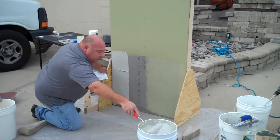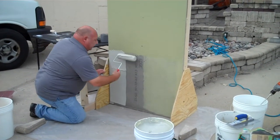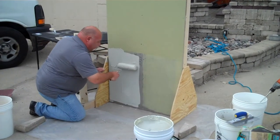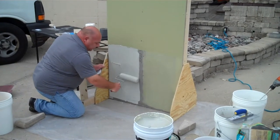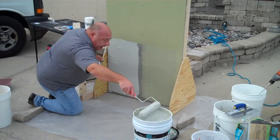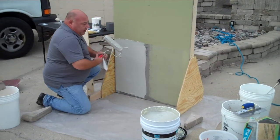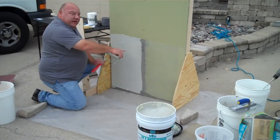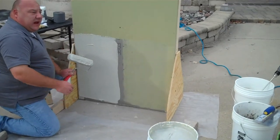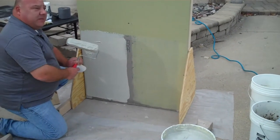And what I'm looking for is, I'm looking between 15 and 22 mils thick, okay, of material, and each coat. So there's actually two coats of material on the wall. So I don't want to be like painting, like you do the W and all that kind of stuff. Now, if you look over here on this side, can you see the lettering? Can you see the cement board? It's somewhat translucent. It's still translucent. That means I don't have enough material on that first coat. You shouldn't be able to read it. What's translucent?